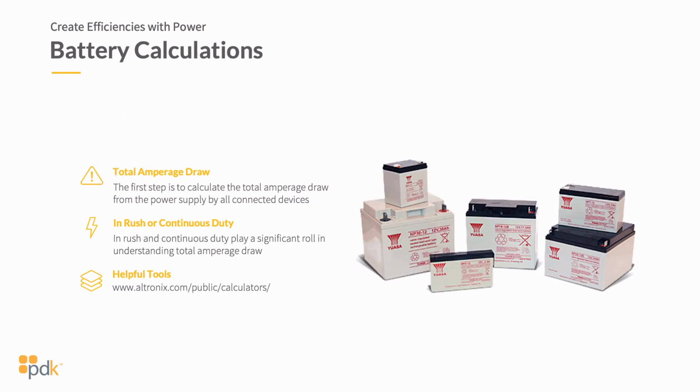So when you look at battery backup, the one thing that you want to look at is your inrush and your continuous duty of your locking hardware, as well as all of the other hardware that you have. So let's list a couple of things that you have at the door. You've got the panel, and it may be an edge device or it may be home run, but regardless, you have your panel, your lock, your reader, maybe a request to exit device. You've got all of these devices at a door, and then you've got your door position sensor. Door position sensor pulls no amperage, so that's not a device that you have to worry about. Your request to exit device pulls amperage, so that has to be taken into account when you're looking at your overall draw and how much battery backup you want to provide, okay?